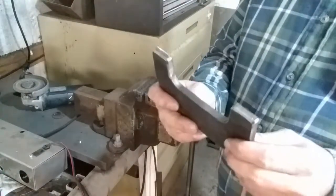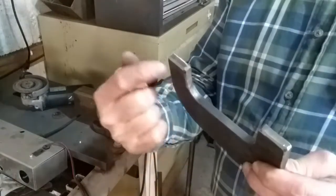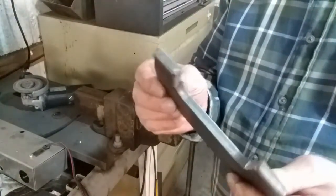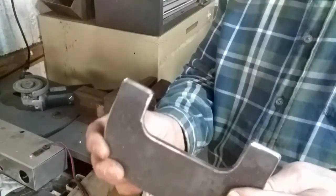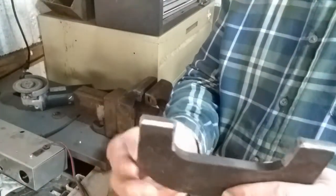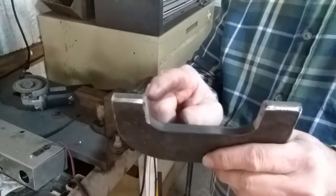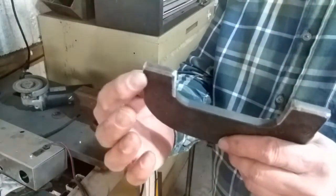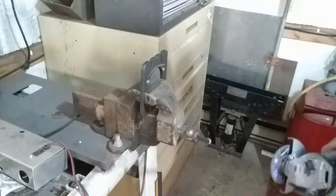As you can see, we've ground all the way around the perimeter of the gusset ends. It doesn't need to be absolutely perfect, but aim for about one-eighth of an inch grind all the way around on all edges. This gusset plate will only stick through three-eighths of an inch into the face plate, so you only need to come down about three-eighths of an inch on each side and end.